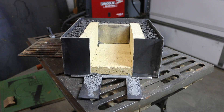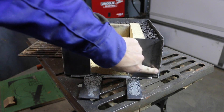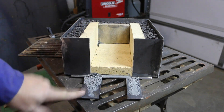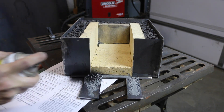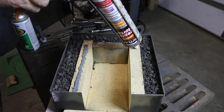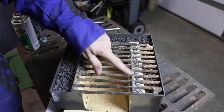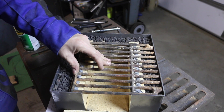I just realized something — I'm going to be covering up metal. So I'm going to hit the front edges here with some high-temperature paint, just where I'm going to be blocking it with that hearth brick. Perfect example of a grinder and paint making me the welder I ain't. I'm going to seat the grill with a bead of mortar, and I'll push it all the way over to this side just because I've got that rail right here and this section crosses the firebox just fine.